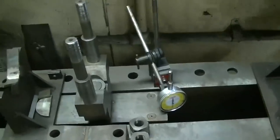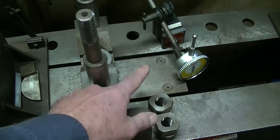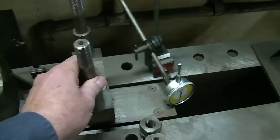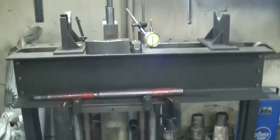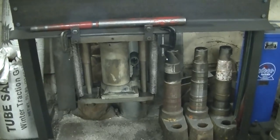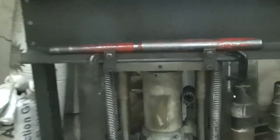I built it years and years ago. It works basically by pulling this block down. It's got four strain bars that travel through a plate. It's a 20-ton jack on this thing, but it pulls straight, so you don't have the problems you do when you're trying to push things around with an H-frame. The jack is sitting on the bottom, and it's got the four strain bars that go up with tubes.